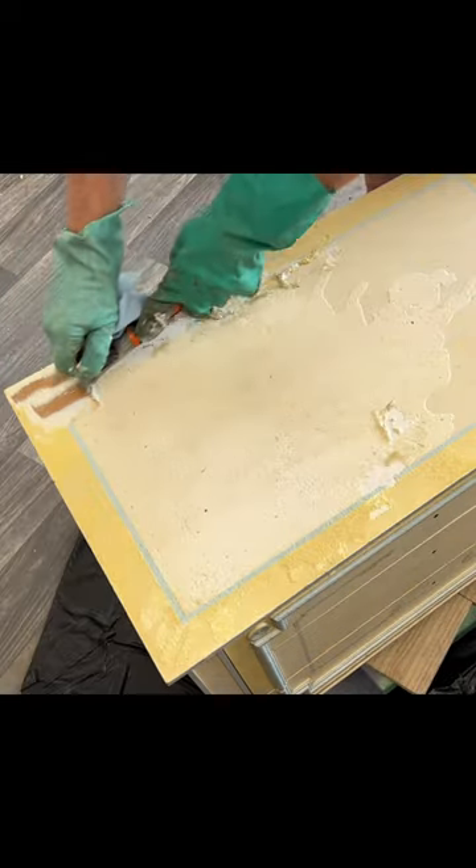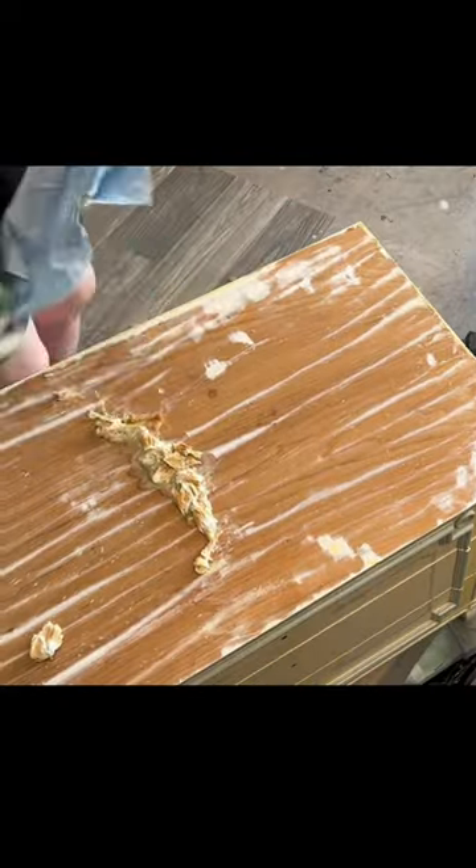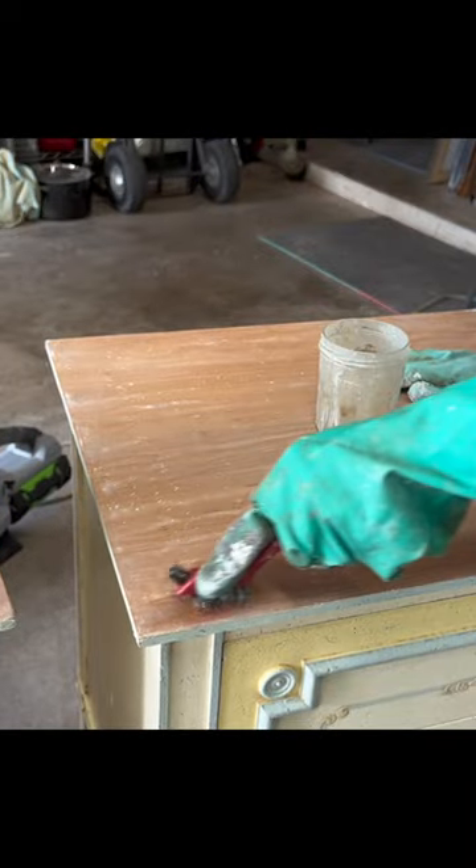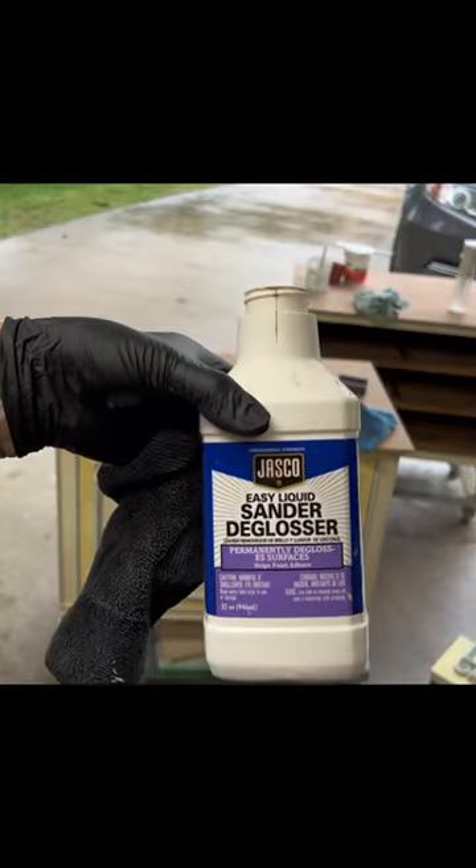This flip had a twist at the end. I started with a really good clean and stripped the top with acetone — it came off really well, but I was left with all the little paint in the distressing marks. So I went back in with some acetone and a wire brush and got all of those little bits out.